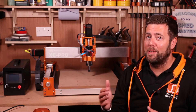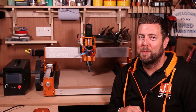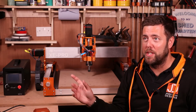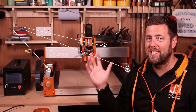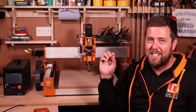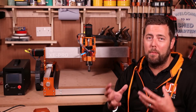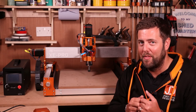They're already thinking ahead, and you can move on pretty quickly with this machine with the stuff that comes in the kit. There are two upgrades ready for this machine — well, one is ready now and one is coming very soon. There is a linear rail upgrade kit available for the X and Y axis, similar to the linear rails on the Z assembly, helping to keep things moving smooth and more precise without any wobble — definitely an upgrade to consider if you want to machine harder materials such as soft metals, aluminiums, and brasses.